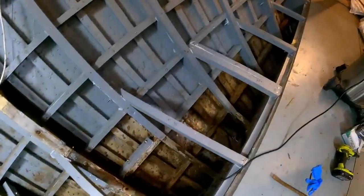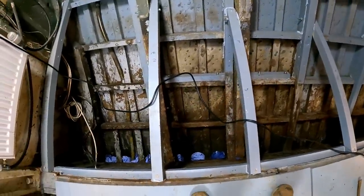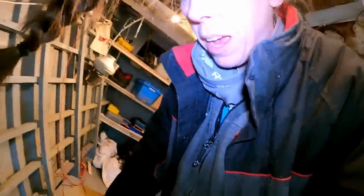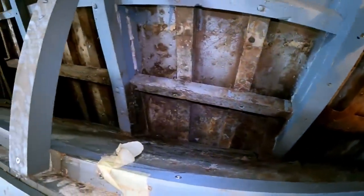I've spent all morning and most of the afternoon cleaning the bilge — cleaned as much as I physically possibly can. My back is aching from being down there, but I've cleaned it all, washed it, wiped it, and acetoned it. It's ready for paint. I'm not going to do the couple of sections right at the bottom though, because it's a little bit damp down there — I don't want to paint over dampness. That needs another couple of days to dry, but everywhere else is perfect.